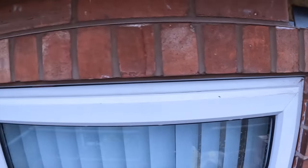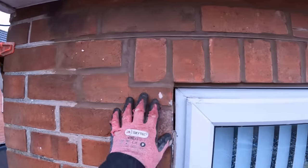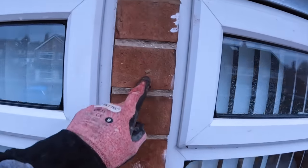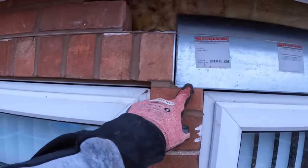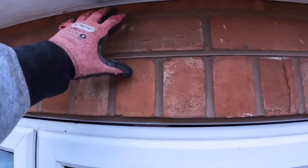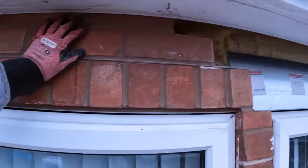Right, there you go. There's Saturday's effort. I've cut the brick down, slotted the lintel in 100mm, and because of this silly 100mm pillar, all we can do with that is 50mm either side, seating for each lintel. That would be an issue, but that's it above. Brick and edge, two course of brick, holding nothing. That's just purely decorative, if you like.